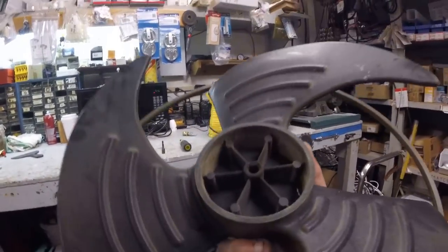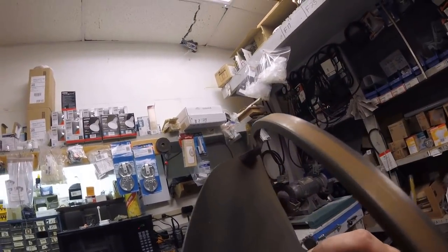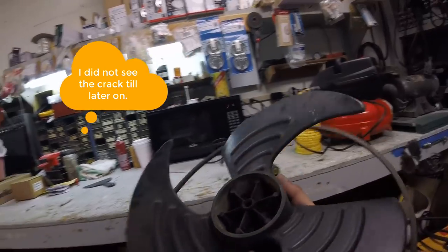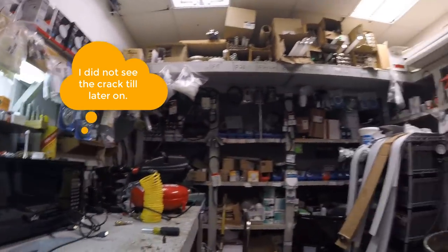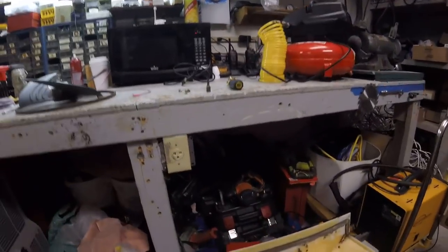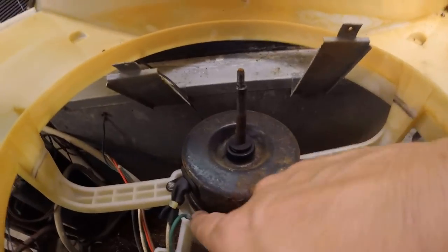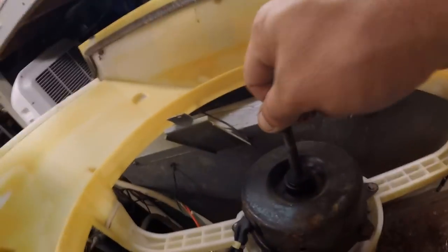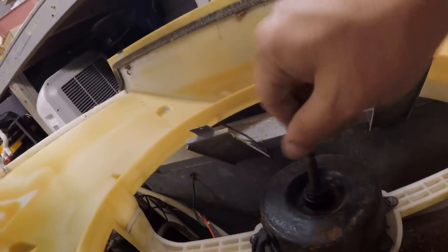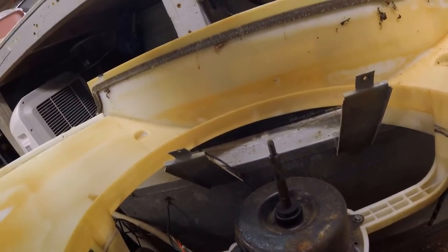And look at that, the fan just pulls right off. What's so funny is that right here, it's worn down on this fan edge blade here. This fan blade looks normal. I mean, it's not that different than what I'm about to put on there. Hopefully there's not something, I don't know. That's pretty solidly affixed to there. It could be a wobbling shaft, but it's not. I don't feel any wobble in it from any direction. The spin seems normal. It's not cutting out on thermal.